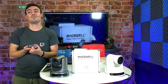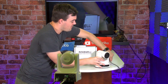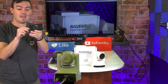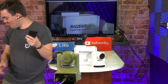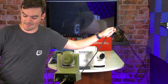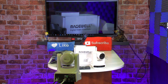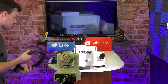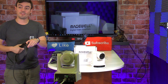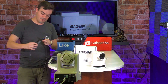Let's go ahead and set this up so I can show you how it works. First of all, I'm going to plug this into Ethernet. Ethernet is going to provide power to the device. It uses DHCP, so this thing is going to grab an IP address. I've got an HDMI cable here — it's kind of long — and I'm going to plug it into the back of our PTZOptics camera, which has an open HDMI port. I'll go ahead and slip that in there, and then plug the HDMI into our Pro Capture device.